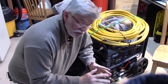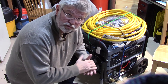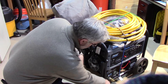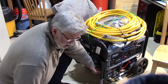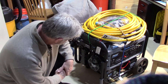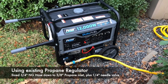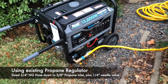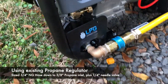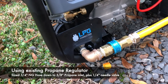Let's talk about my generator — Pulsar 12KW. I'll get close-ups for all of this, but the action is really happening in these locations right here. Previously we had a propane connection here. This is connecting the natural gas supply into the existing propane regulator using a needle valve to help manage the flow a little bit.